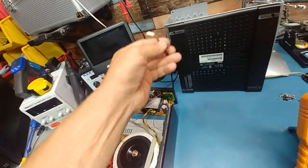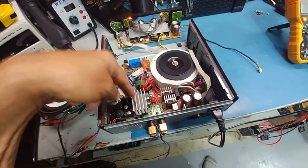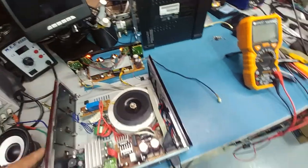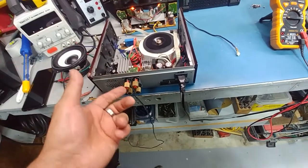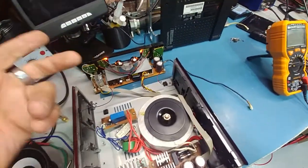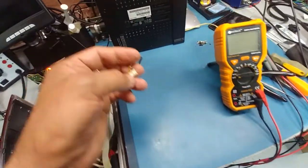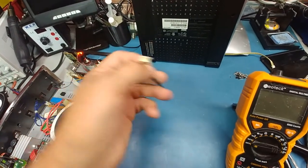This lead here is left and right in and left and right out. I'm not too sure about this amp section - I think it may have seen better days, not that I'm going to lose sleep over it. If I can get the preamp working with the lights, I'll just disable the amp stuff here, remove those connectors for another project, and put RCAs in here so I can use this preamp. The high voltages are there, the rail voltages are there, and the filaments are lit up - so it should work in theory. I'll pin out the board using the legend and give it an input and output and see what I get.